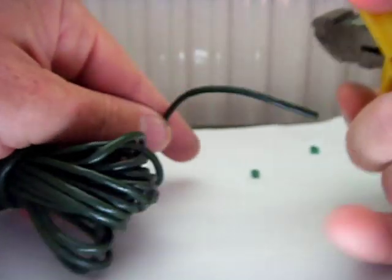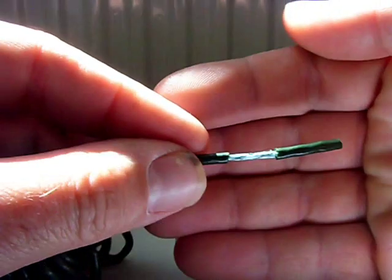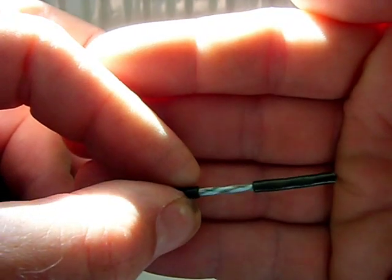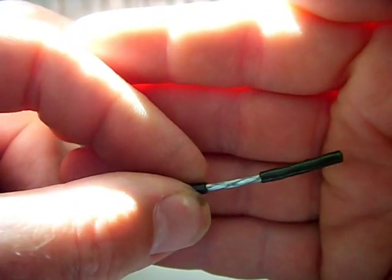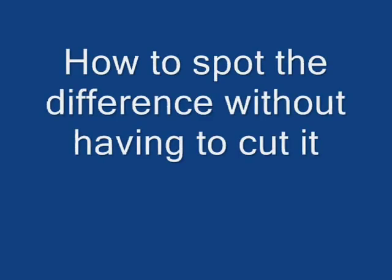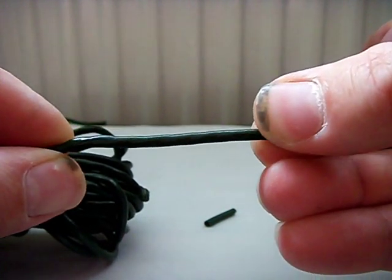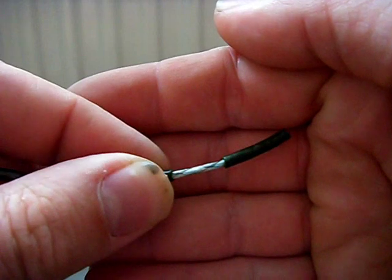This is the darker green material — I call it the dark green lumpy wire. I'll attempt to strip a bit off and see what happens. As you can see, this isn't like a whole shield as it was on the light coloured stuff; it's only slightly wrapped around it. So this is probably going to have a different resistance and won't be as wide-banded. You can make it out because you can just see the wires on the outside, which gives it away as not having solid shielding.